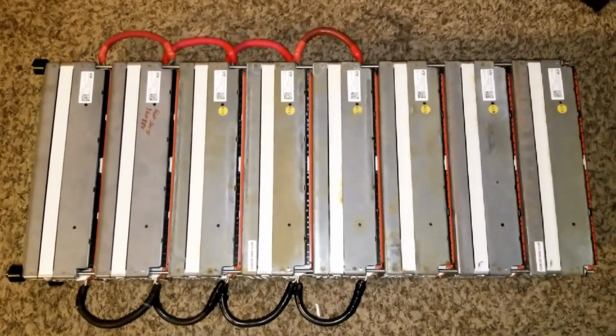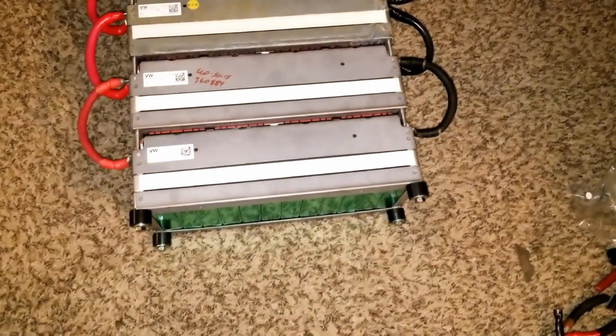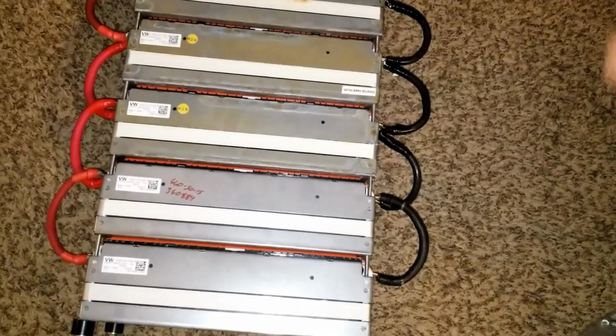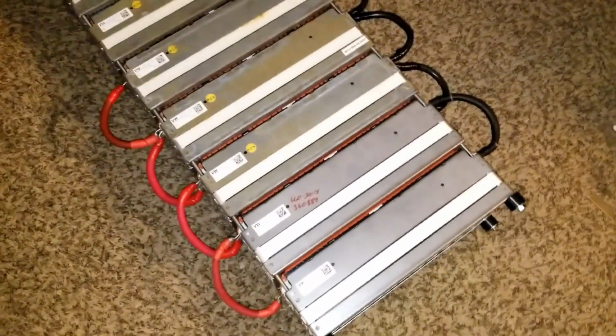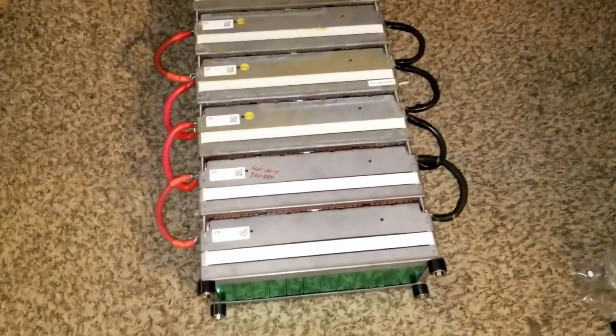So use the safety precaution. Use a dolly. This way, I've done this. You can put a dolly on the back here, at the bottom, so it hooks all the way down and doesn't injure the batteries. Or you can put something here like a foam so you don't puncture any of the cells. Just be mindful how you do it, and be watchful for the sides, because you already have your parallel connection there. Now if you string the batteries, you're going to end up knocking out some of these connectors, and you're going to hurt the batteries from inside, unless you have to open it up to solder or weld it.